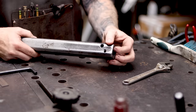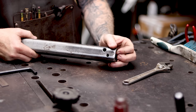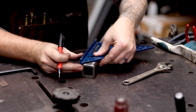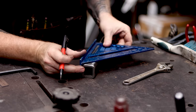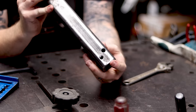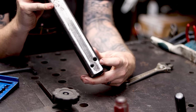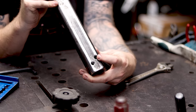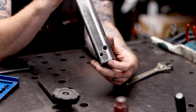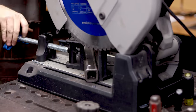The reason is that this metal impedes the angle at which we need to turn the True Tilt Table up towards the platen. So this is just in the way and it's not doing anything — let's just make the Gen 4 a little bit lighter. When making that cut, leave enough room between the top bolt hole and where the cut's going to be. If you go right from the corner it's actually going to go right into your hole, so you just want to take off as much as you can without impeding those holes.